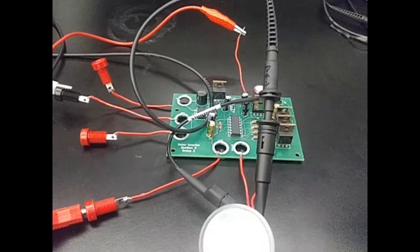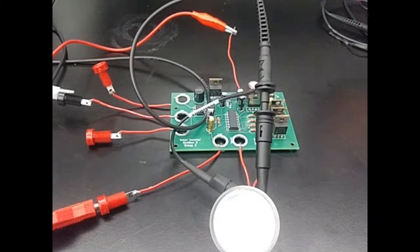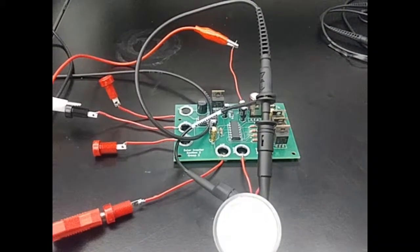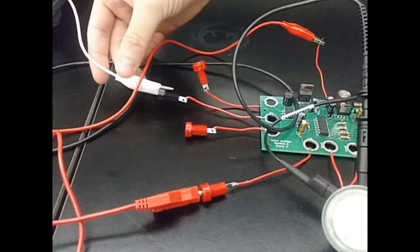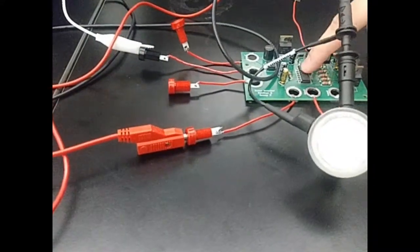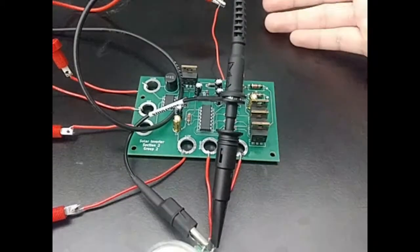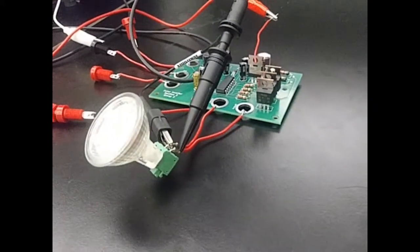John will be showcasing the inverter portion of our project using a DC power supply. So this is our PCB layout that we designed. On the left half is the boost converter, and on the right half is the inverter. However, the boost converter does not work, and that was explained beforehand. This cable that you see is providing ground to the PCB. This cable provides the 15 volts to power the chip, and this cable also provides 15 volts for the inverter. And our output, we should expect roughly between 20 to 25 VAC.